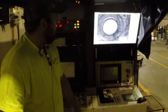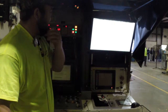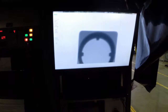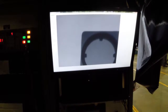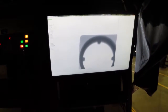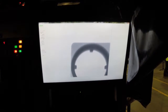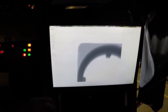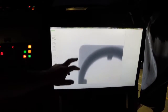And then we have a casting part that has inclusions in it, and you can see it fairly well. You can adjust your KV and zoom in — right in this corner here with your mouse. As you can see, it's a little lighter in this area right here; those are inclusions. This is a positive image in that the dark part is your thick section and the lighter part is your thinner section. So it's missing material for that inclusion right there.